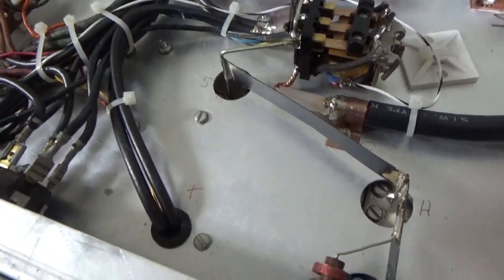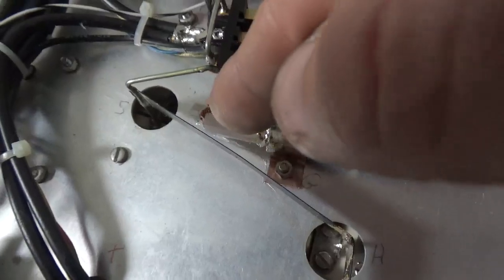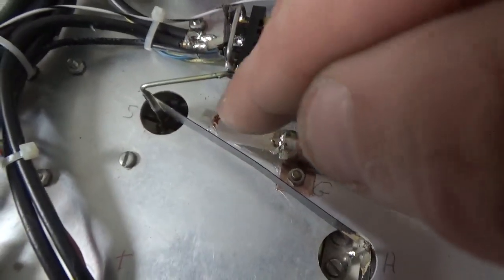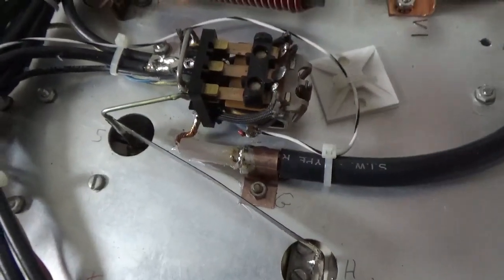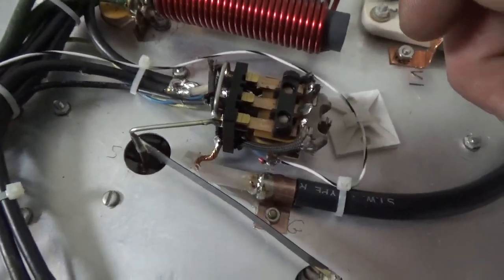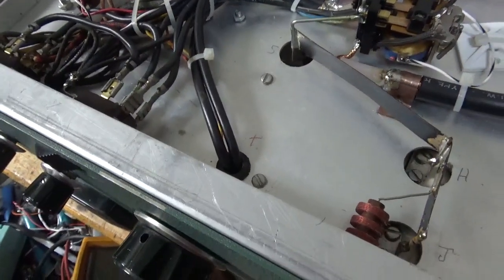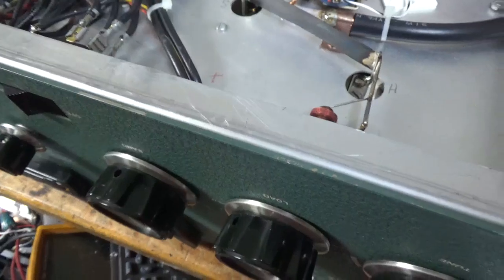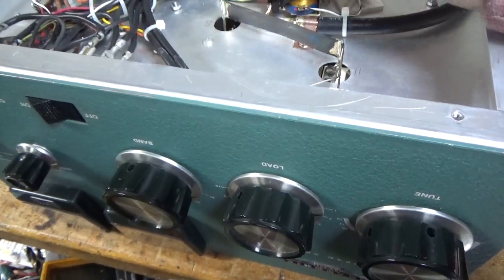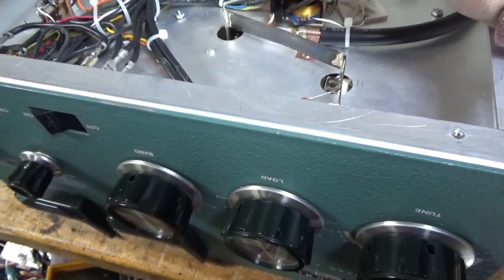And that's about it — just a lot of time here. I also put some silicone between the center insulator of the output coax and the chassis, because it's about a little over a quarter inch between the center conductor and ground. Just in case — keeps it from getting close. I re-soldered the center conductor wire to the relay. Lots of solder touch-ups and all sorts of other stuff — this thing is all set. If you need any amplifier repaired, feel free to give me a call. Phone number is 203-892-4119. I also cleaned the TR/bias relay with Deoxit Gold. Thanks for watching. Have a great day.